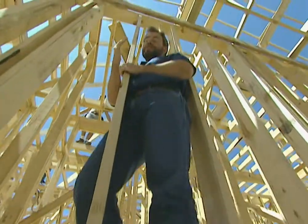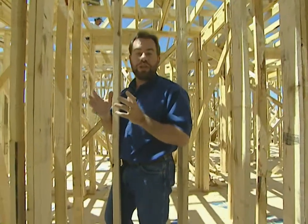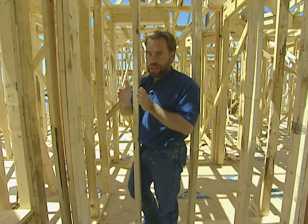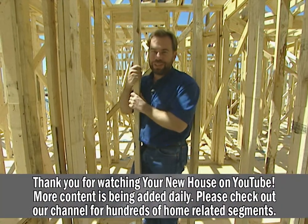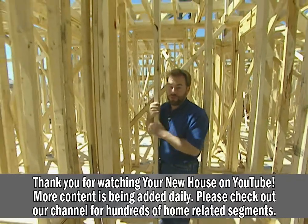So if you want a good quality floor that's not going to squeak, there are just a few things to remember. Use an engineered wood I-joist system. Put on thick decking — maybe even thicker than code requires. Make sure glue goes all the way across the top of the I-joist, not just part of it. And make sure all nails or screws go through the decking and into the top of the I-joist, not beside it — it doesn't help if they're next to it. Do all that and you might be able to make it to the refrigerator at midnight without the family joining you.